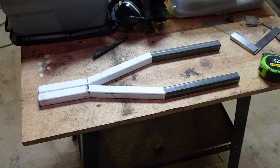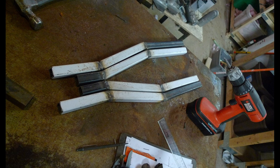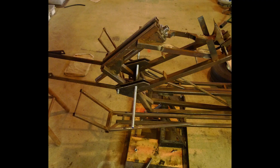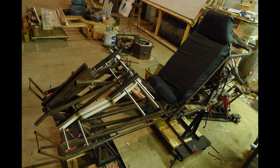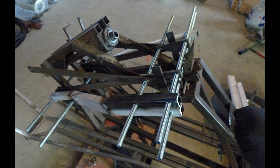The next pair goes through a similar process, and here are both pairs together — they spread outward to make room for the steering column latch assembly turning when you steer the wheel. To make sure everything lines up properly, I put steel dowels or threaded rods through each mounting hole. You can see them passing through both mounting plates on either side. I used those rods to ensure the new virtual pivot point bars all line up properly on both sides. Here are the first couple of pieces all mounted and lined up — everything seemed to work out quite well.